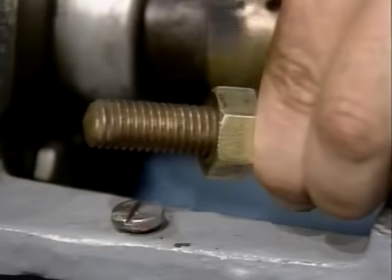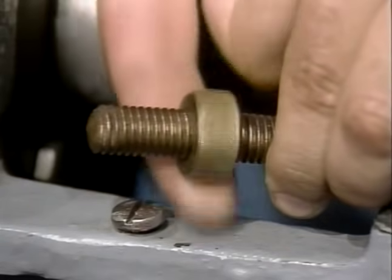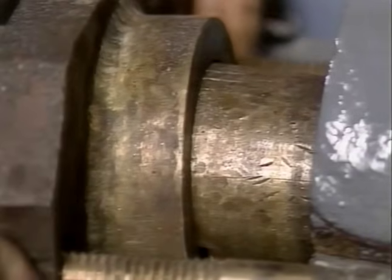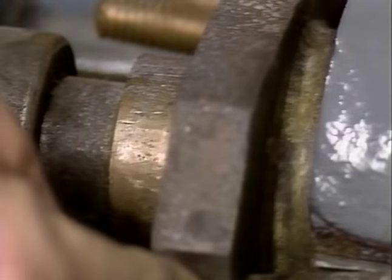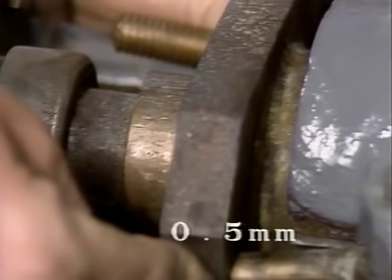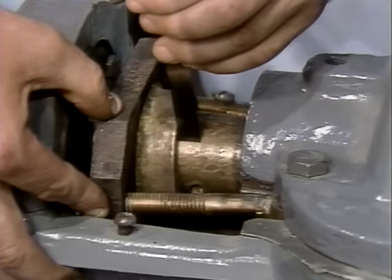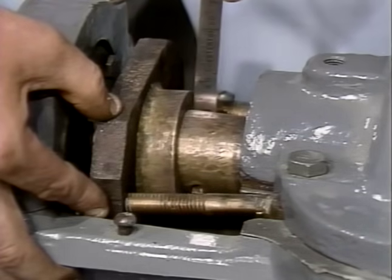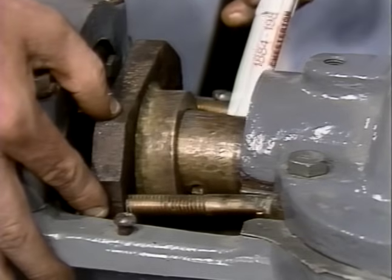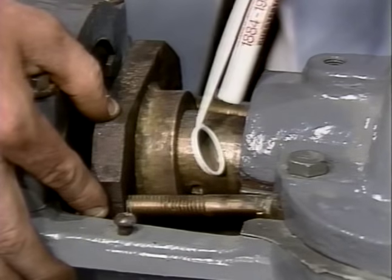Check the condition of the pump further by examining the glands' bolts and nuts. The nuts should move freely and the bolts should be free of rust and corrosion. This will allow for correct and uniform adjustment of the new packing rings. The gland nose or pilot should center correctly in the stuffing box and its clearance over the shaft should not exceed 5 tenths millimeter radially. This close fit will eliminate packing extrusion. Verify that the lip on the gland is perpendicular to the shaft and in good condition. The lip should squarely contact the installed packing rings to properly transmit the gland force to the set of rings. Finally, check the clearances at bottom of stuffing box. Clearances over 5 tenths millimeter radially may require the use of an anti-extrusion ring at the bottom of the stuffing box to prevent extrusion into the pump.